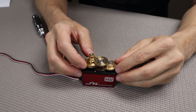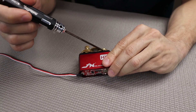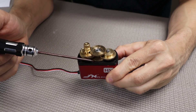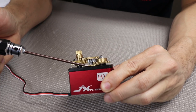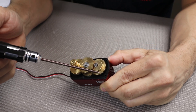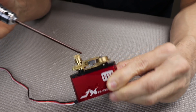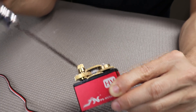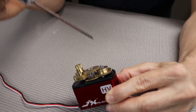Here she is all put back together. If we take a look at what's going on here we can follow the process. We start out down here with the drive gear, and then we're driving this large gear which has a small gear on it, which is driving the next large gear. That large gear has yet another small gear inside of it, which is driving the final output shaft. So at each one of those points we're building a good amount of torque, but we are losing a good amount of speed.